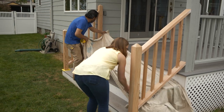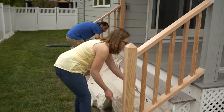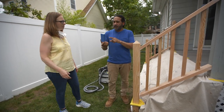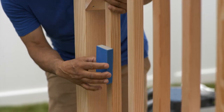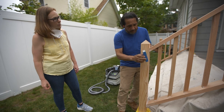Let's pull this all the way down, all the way down here like that. All right Caitlin, it's time to do some sanding. I'm going to hand you this 180-grit sanding block. What I want you to do is just smooth some rough areas, nice and easy, break the edges a little bit so the paint adheres better to it.